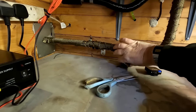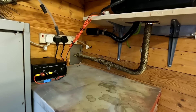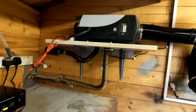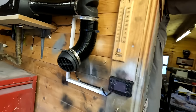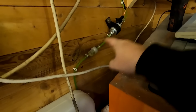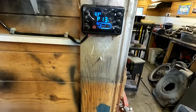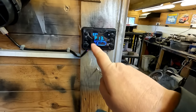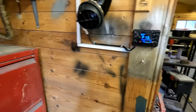I can now fire it up and start to get warmer. For those who haven't seen my setup: I've got a power supply on there — you can also put a backup battery, which I may do later. It's a five kilowatt V4-1 unit; I'll leave a link in the description. Coming around this side of the wall is my fuel tank, with the fuel filter and pump going through the wall. When you turn the power supply switch on, you can turn the heater on via the remote or via the panel, and the reason for using a switched supply is that the LED stays lit when a battery is connected, which would drain it down.